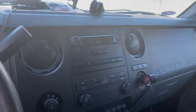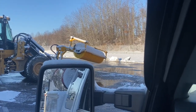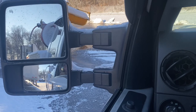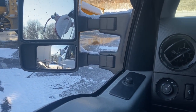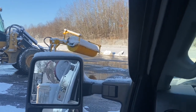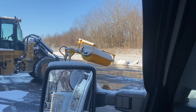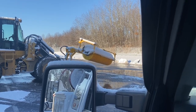It's almost 9 o'clock and I'm ready for a nap. We got to sit here and wait for trailers to come by. We've swept two trailers off so far — been sitting here about an hour. We got a broom down here that goes on the front of a rubber tire loader and sweeps the trailers off. It's pretty slick — you just pick it up, set it on top of the trailer, pull the valve for the auxiliary hydraulics, put a little down pressure on it, and the truck drives away with all the snow off the other side of the trailer. Works pretty good.